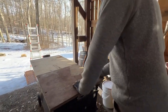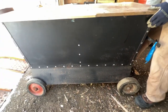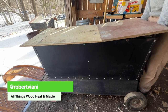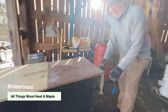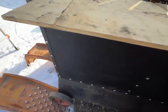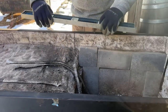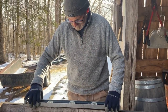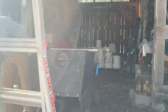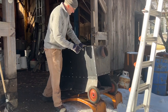Line her up and get her up on the ramps. When the evaporator is set on the ramp, we use a level to check it front to back and side to side to make sure there are no low spots in the pan. This is important, especially when we get down to the end, when we're cooking it down to three gallons and under. We don't need any low spots. Shims and a little bit of motivation usually helps get it level.